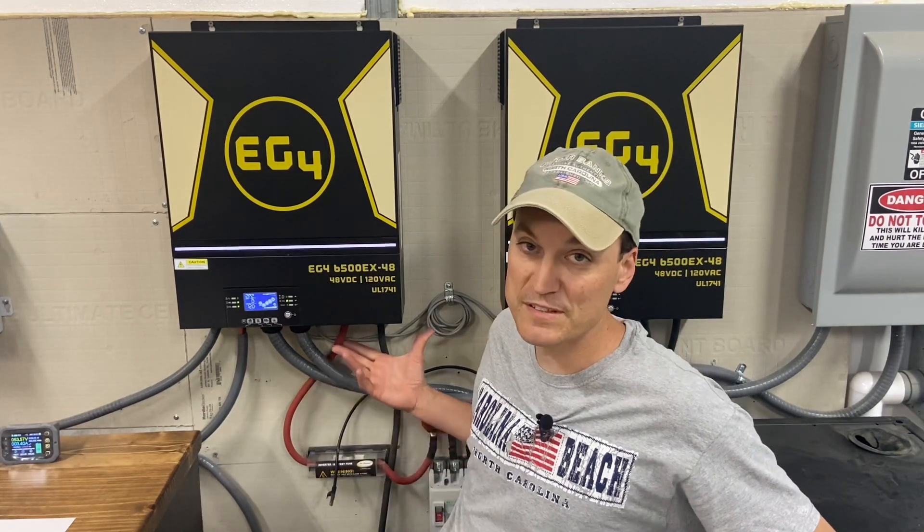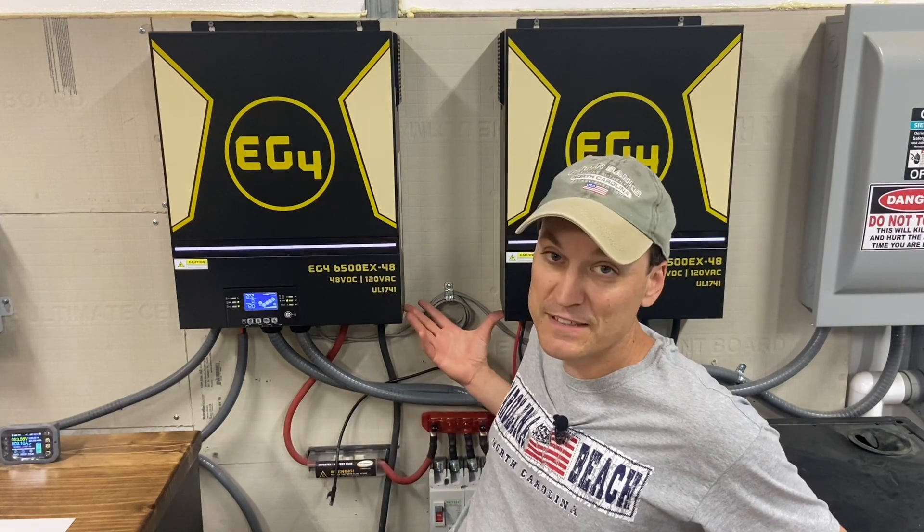Just to give a little background — I am running a 48-volt system here. I am using LiFePO4 batteries, lithium iron phosphate, and I have a 13,000-watt system. Watts' law and Ohm's law is what I'm going to be talking about today, so if you wanted to research that, it's a really good idea to do so if you're installing your own system or curious about it.